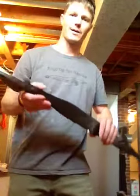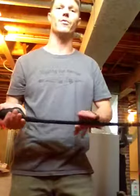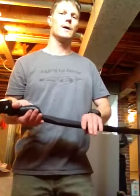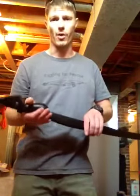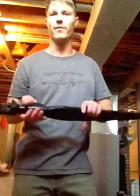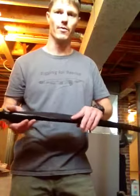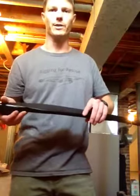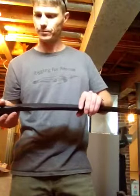Had I it to do over, I would have reduced the bow to get down to about 55 pounds at my draw length. If I chose to shoot a bow that was that heavy, I probably should have backed it with fiberglass material or snake skin or PVC or rawhide or whatever. Probably would have gone with the least expensive and tedious of that and backed it with fiberglass. Having said that, the Black Mamba is dead. Long live Black Mamba number two.